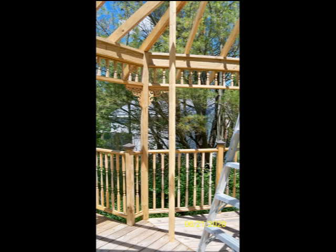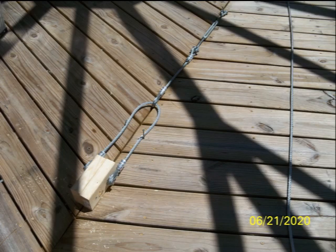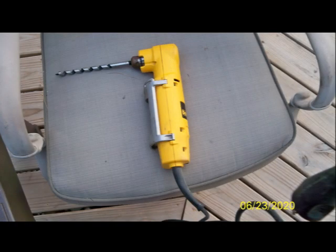I'd made the eight cable harnesses, but I hadn't made the part that goes from the circle in the center to the turnbuckles. In order to get the correct measurement for them, I first plumbed a 2x4 from where the cable harness would be attached to the double rafter and marked where that attachment goes on the deck. I simulated the double rafter with two 2x4s and screwed them onto the deck, then laid out the harness. I used some rope to get an idea of the length of cable I'd need, and with that I made the part to connect the turnbuckle to the center circle.